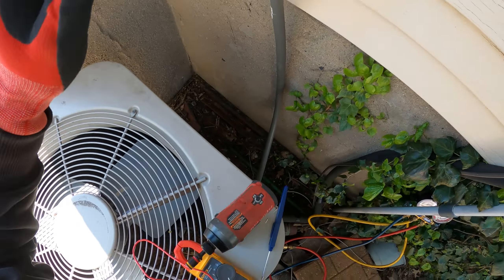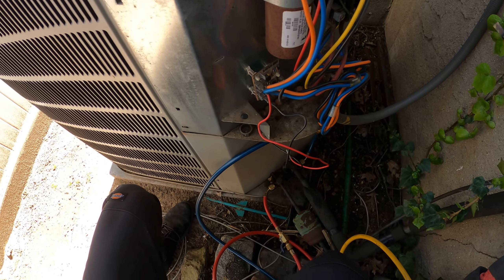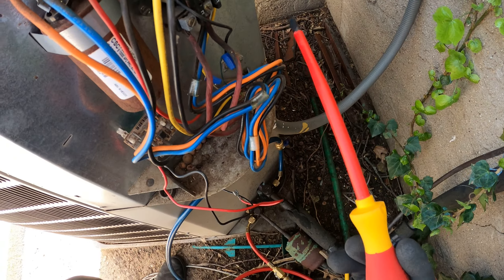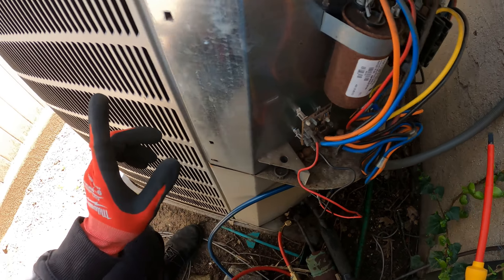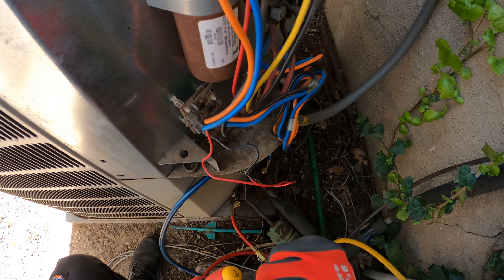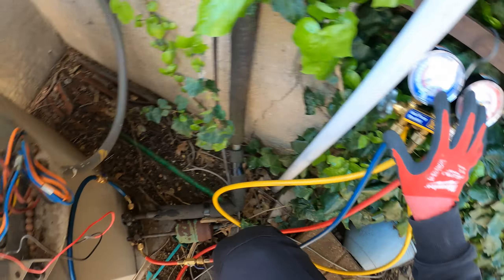What I'm going to have to do is actually push in this contactor by hand to see what's going on. All we got is a buzzing sound. This contactor feeds both the fan and the compressor — this is a dual capacitor — and we only got a humming sound. Nothing happened with our pressure gauges, so let's take a further look.